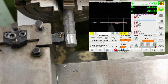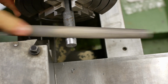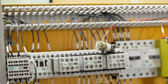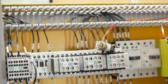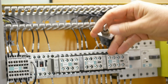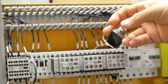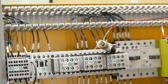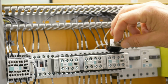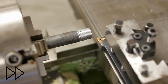Oh shit! Just knocked that burr off. Not enough torque. Maybe the variator setting's wrong. So far I've done nothing about coding the variator control, so I'll just do this manually. Why is that not doing anything? I'm not sure what I've done, but I've got no variator control in the slow direction, so I'll just make a finer cut.